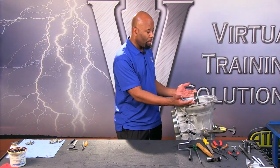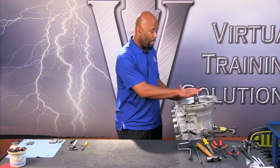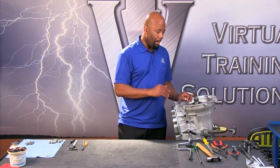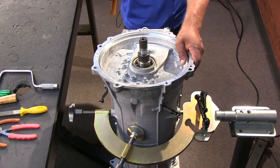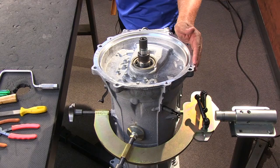So we don't have a bell housing, but we have a removable torque tube housing that goes along with this, and the torque converter is going to be the conventional type of setup — nothing out of the ordinary there. That's why we don't see an integral bell housing. All other models of this unit will have an integral bell housing, non-removable style.